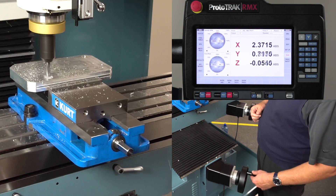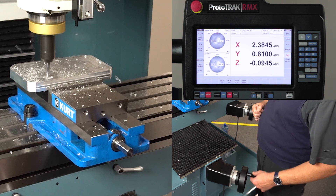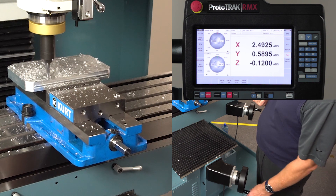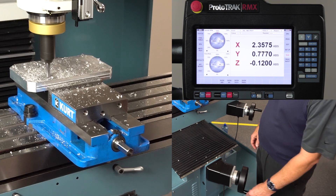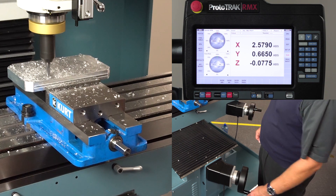As it starts machining through here and it looks like it's doing everything the way I want it to, at that point I can move over and run the run mode. Or maybe I don't see something that I think is supposed to be happening — the other great thing about tracking is I can say that's not right, go backwards, get right back out, and say let's go back and start this over because something isn't quite right.